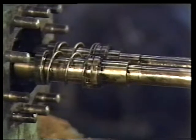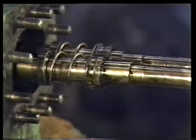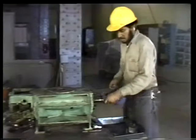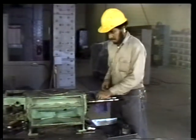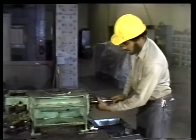In the last segment, we exposed the outboard mechanical seals by removing the timing gear housing, the timing gears, and the outboard bearing bracket. We're now ready to remove these seals. When you've cleaned any surface dirt and excess lubricant off both shafts, you should be able to remove the rotating carbon face, the cartridge, and the spring by hand.